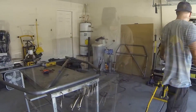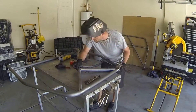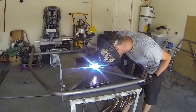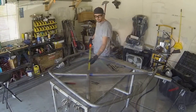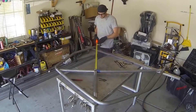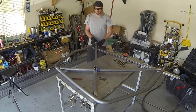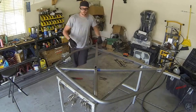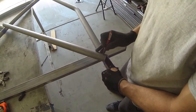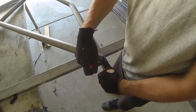Hopefully we'll get it right on the first try — slap this in. We're just going to run with the tack weld right now and not the full weld; we'll get the full weld later on after we get everything lined up. So let's just start with the tack. It's a lot easier working with a smaller tube. We've already measured this one out — we're about the center of that diagonal brace there to the edge, about 37 to 38 inches somewhere in there. I've already cut and cleaned the tube, so we're just going to set it up. Kind of use our eyes here to get it in line and start at the lower corner.